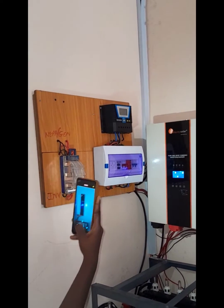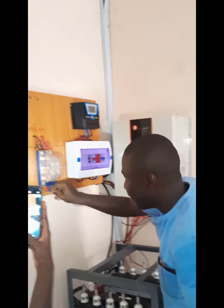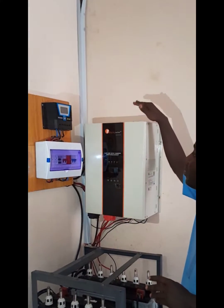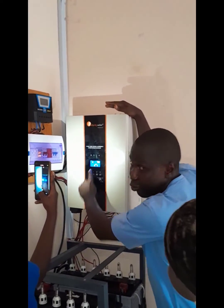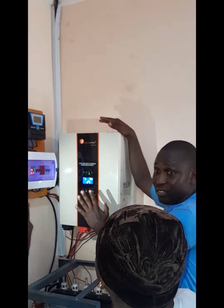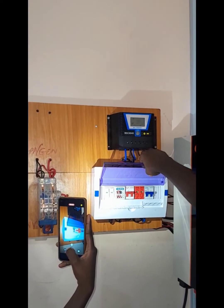That's our protective circuit. We have a PWM charge controller hopping at 60 amps. The breaker for the whole system will trip off, although the way we designed it, even if the inverter is off it can still be charging in the background. They have a small generator of 2.5kVA and a big generator. I told them that when using the small generator they can trip off the inverter. When using this function they trip both the input side and the output side of the inverter.